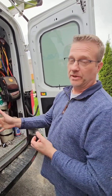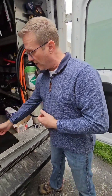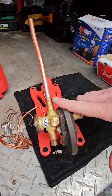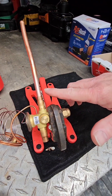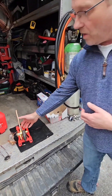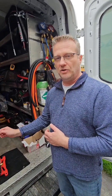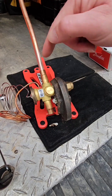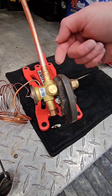You're in a battle against the valve trying to absorb heat away from the joint versus how much heat you're putting on it. Use concentrated heat — heat the connection of the valve first with the torch tip pointed away from the valve. Once it starts to glow, bring it up onto the pipe to raise the pipe temperature, then apply the 15% silphos. Let it flow all the way around and make sure you have enough heat for good flow — you want it up inside the valve.